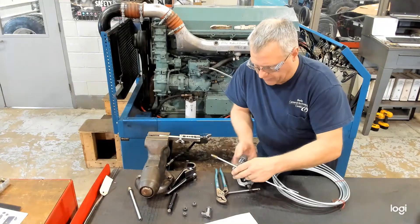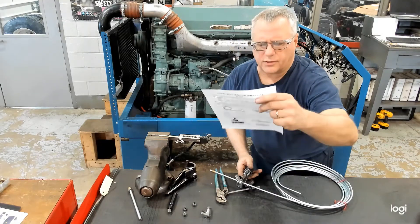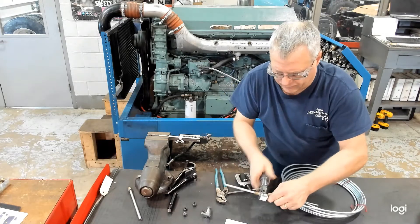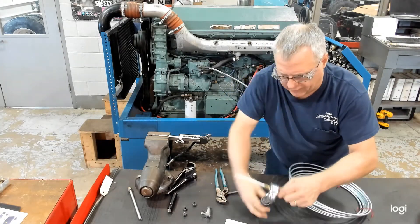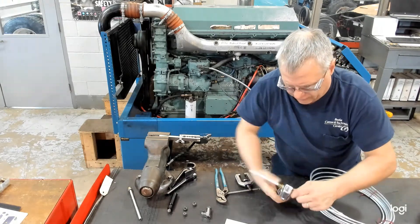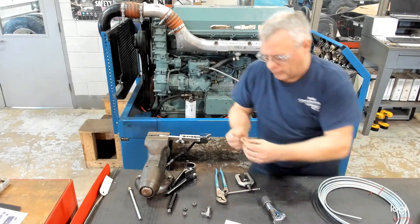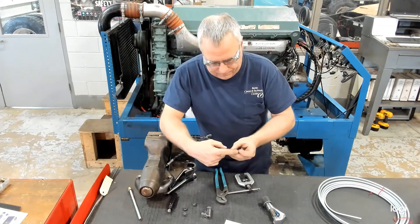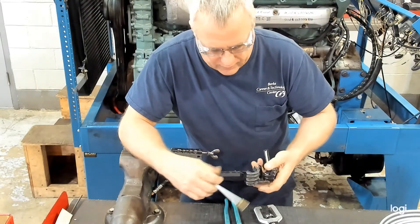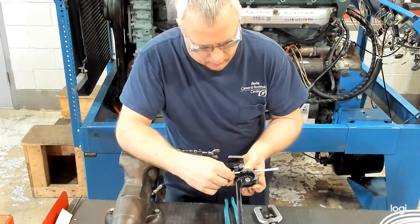I'm going to cut this piece off — I want to demonstrate one more thing. Whatever the desired length is for your project — in class we ask you to cut either five or six inches of steel tubing. I'm going to show you how to use the tubing bender we have in the shop. There are various types: some look like a spring, some have a fold-over arm like a pair of pliers. So we have our tubing here, and wherever we want the bend to be, we've got to figure out what the start point is. You would place that mark in line with the zero on the front of our tool.